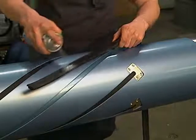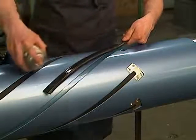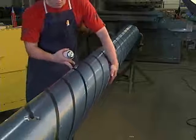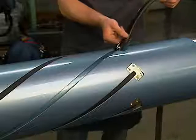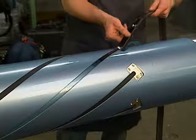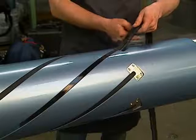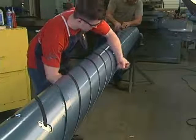Take the new element, which will be longer than the length of the slot, and apply a liberal amount of silicone lubricant to the element and to the element slot. Insert the element into the slot opening on the non-valve end and begin to push it through. It may take more than one person to guide the element through the slot depending on the length of the shaft.